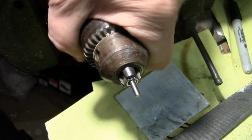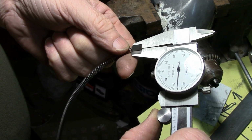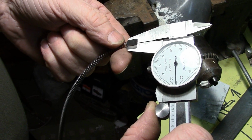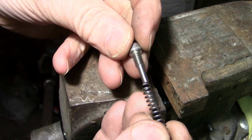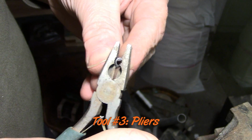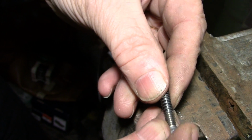That will certainly work. The spring we ended up using has a wire thickness of 25 thousandths, only 1/1000th thinner than the stock spring. This should be a good starting point. The spring fits neatly over our new overtravel spindle. Slightly squash one end of the spring to help it grab onto the overtravel spindle at its base.